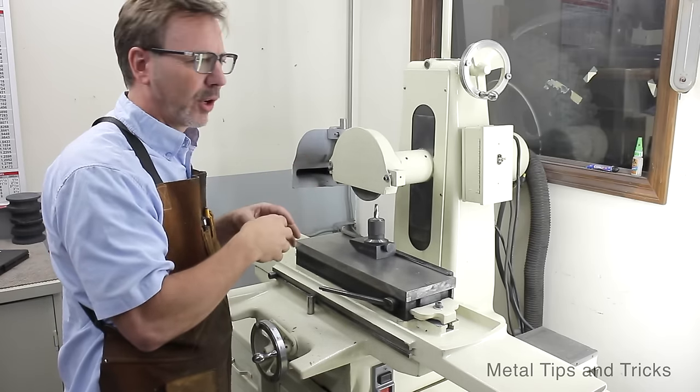Now, we're going to keep it in the up position, and we're going to rotate this 90 degrees. Now we're going to do the secondary clearance angle. You have to inch in on this because the geometry should be that I should just be able to rotate it and everything lines up. Well, that's not going to happen. We're going to traverse with the Z-axis.